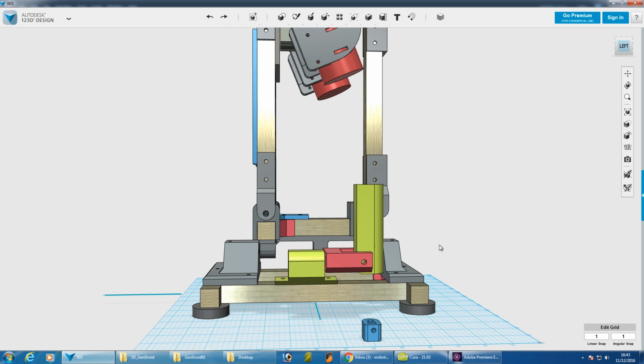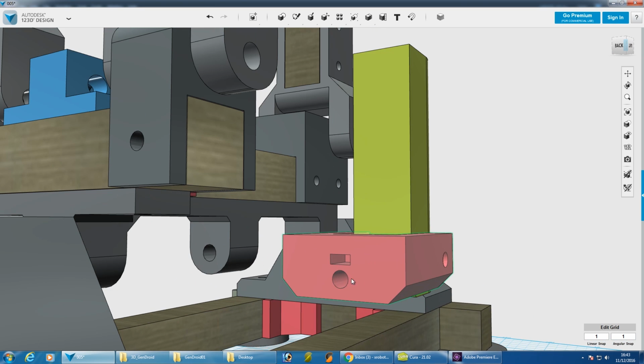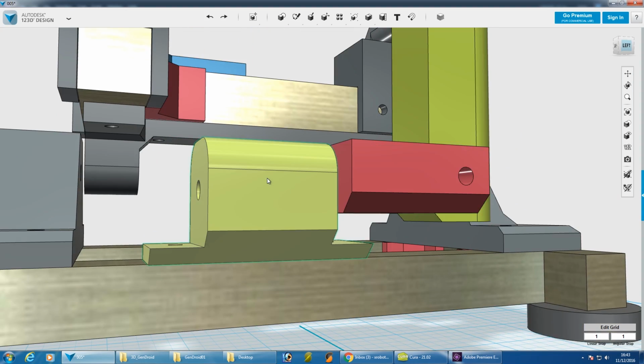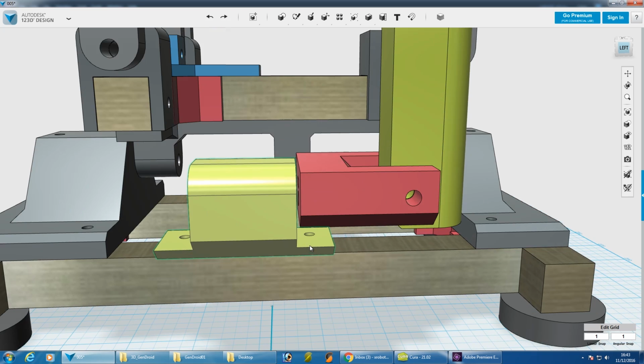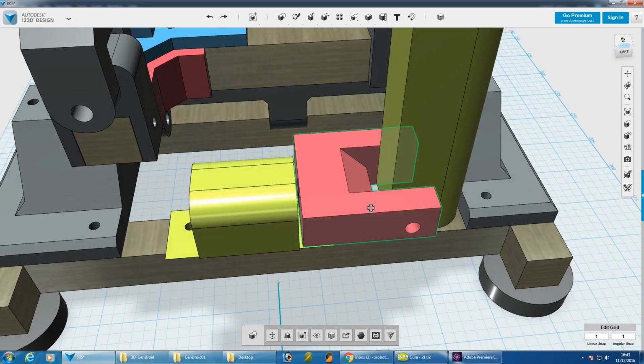Now the issue is, of course, we need to have enough length of 6mm steel that we can keep that thing stiff. So within the red part there's another captive nut and a place to put quite a long piece of it before we get back into the other axis, but that does make this thing very long, so there is still possibility for flex in this. Obviously it's bolted to the aluminium rail at the bottom. The only thing that can really flex are the 2 forks on the side.